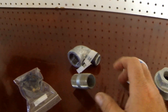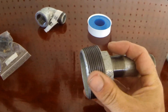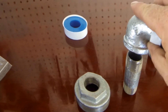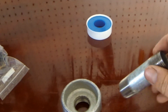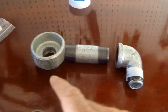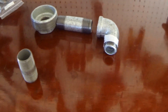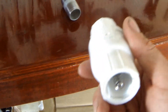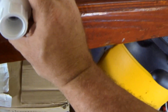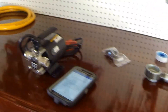I've got a couple little things here. I'm going to put that in — this goes into the attachment on my tank, and screw that in the side of the dump valve. Then I'm going to put the 90 on, then I'm going to put a filter here. In the filter, that goes in the other side. Check valve goes this way, then I'll put another nipple there, and then I'll put the hose to attach it to the pump.